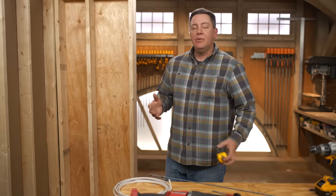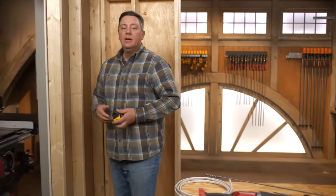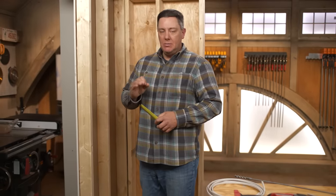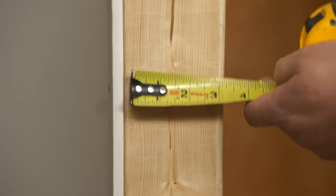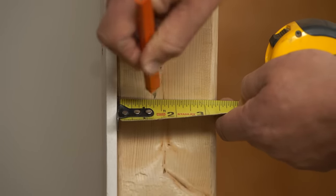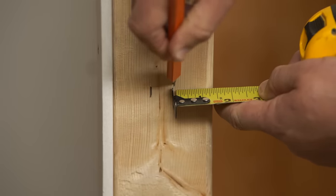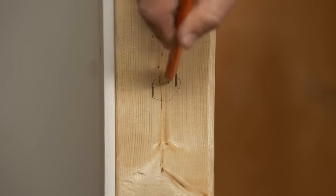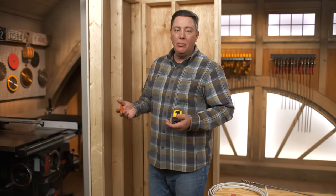Let's go over one of the biggest rules when it comes to drilling holes for wires: the clearance from the edge of a stud. The code minimum is an inch and a quarter. We want to be an inch and a quarter away from any of these edges. So with a two-by-four, we need to be an inch and a quarter in from each edge — that's the spot we have to drill. In theory that should be exactly one inch of usable center, but the studs vary slightly, and I'm not able to drill exactly in the center every time with a one-inch bit.